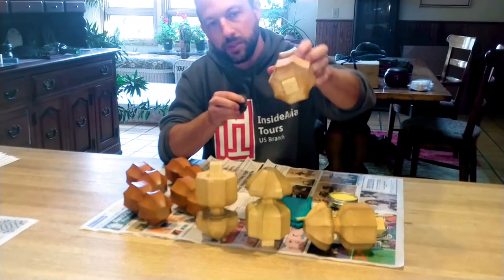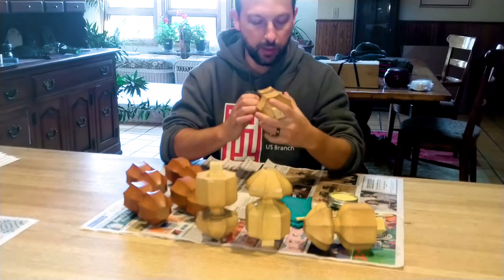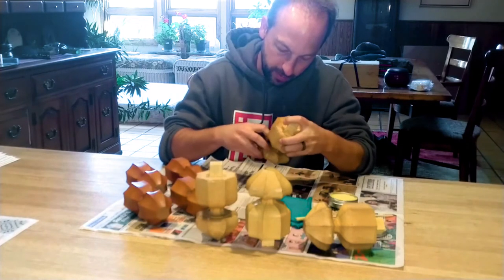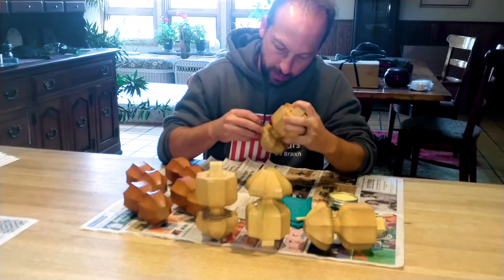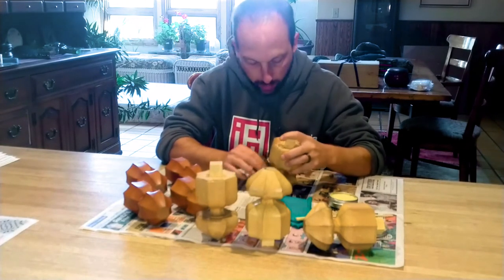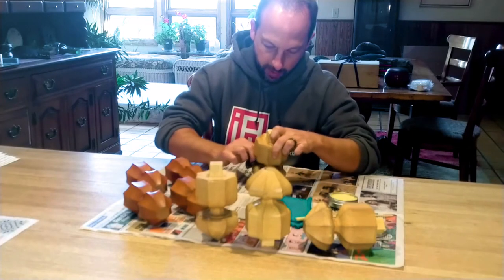With these gardenia-shaped legs, or what is it in Japanese? Kuchinashi. There. They collect a lot of dust and dirt, and they're a bit hard to get into. So I feel like I'm almost cleaning as I'm going here, with the steel wool acting like almost a sandpaper. Cleaning out the dust and debris, working in the linseed, and leaving behind a waxy residue. So we'll work that wax in.